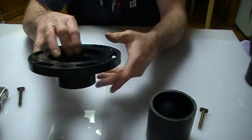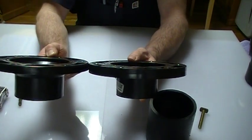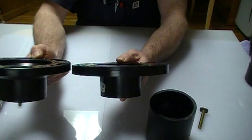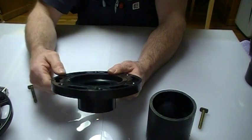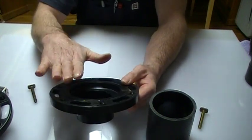The reason being, this floor flange is a little thicker than the normal floor flange — actually it's the thickest of all the floor flanges. And what you can run into if you don't do that is it'll be a little higher than it should be, and you can have your toilet actually off the floor.